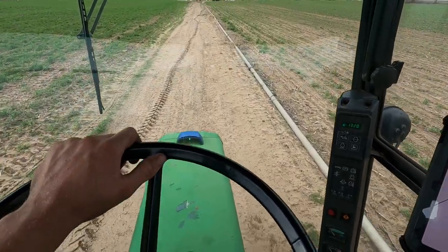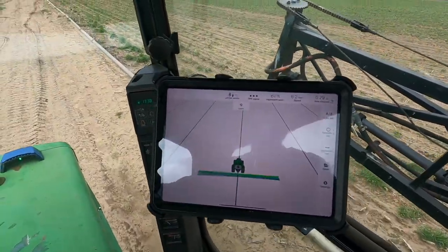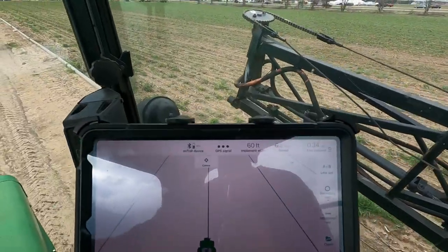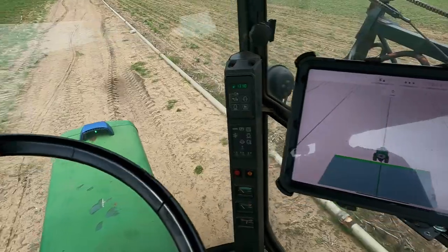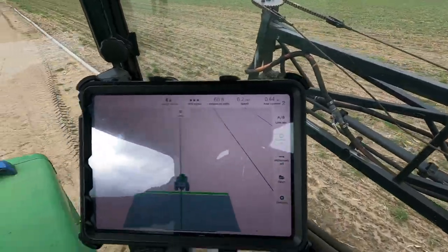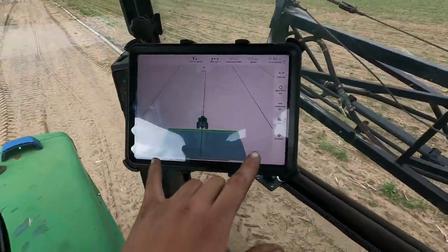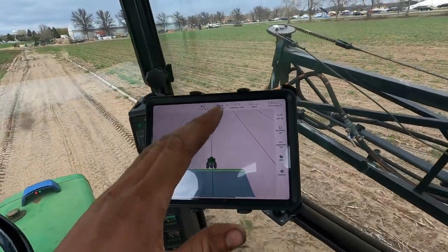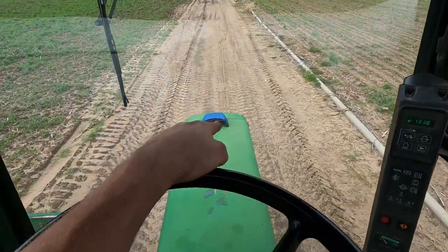Let's say I want to start mapping my acreage — my covered acres. You just tap the screen and that pulls up your coverage map. I have it set for 60 feet right now because this sprayer is a 60-foot boom. That records the amount of marked acres — the acreage you are actually marking on the screen. I've heard it's not 100% accurate but it's very close and gives you a very good estimate.